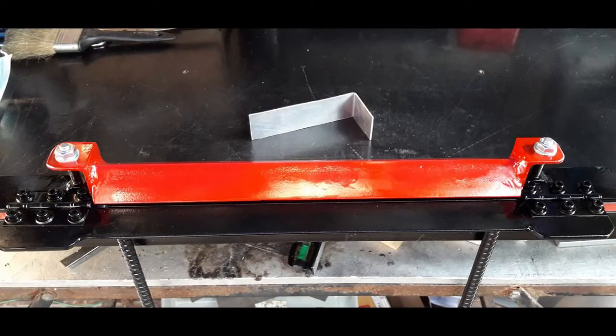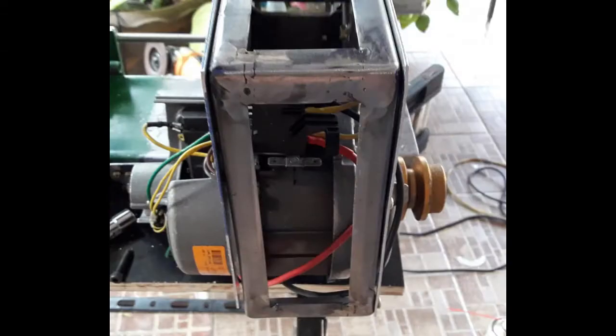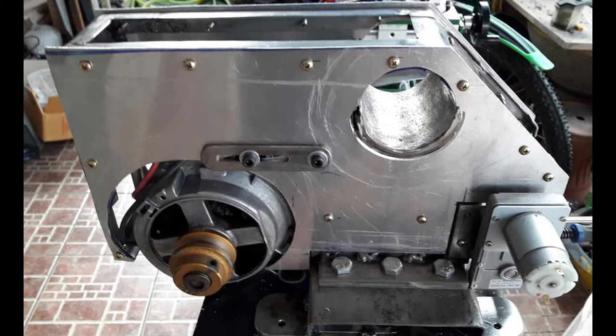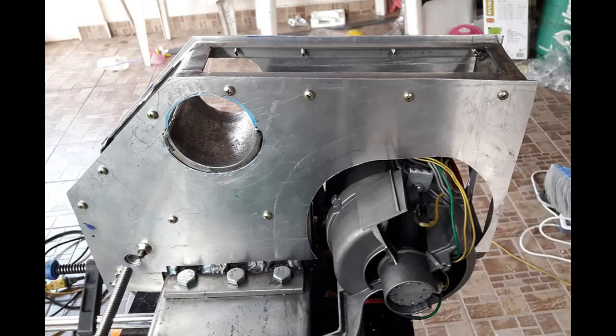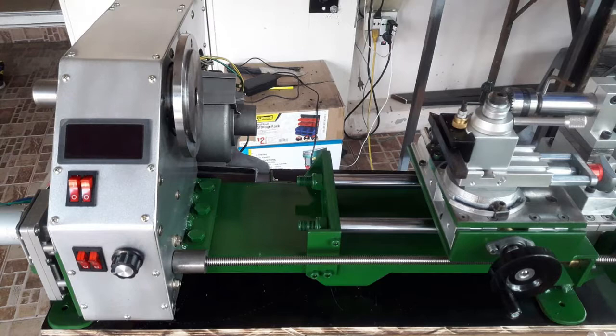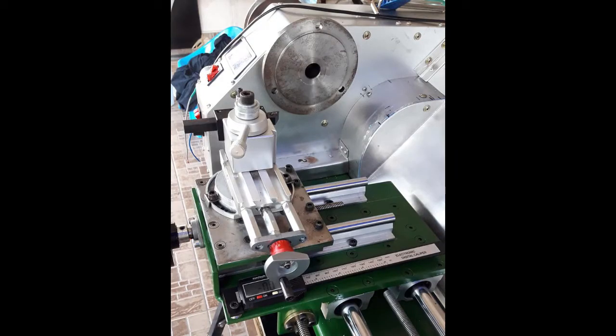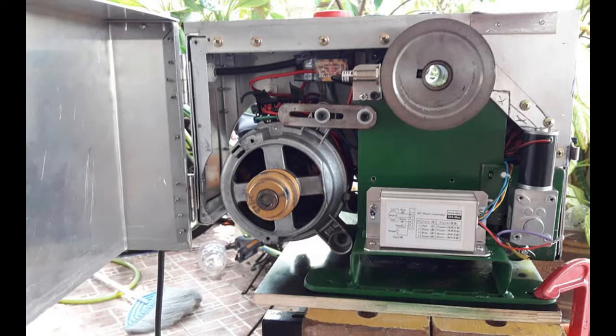When I got to the point where I wanted to start building some covers, I made myself a small sheet metal bender which just clamps onto the bench and does a pretty good job, as you can see by that little sample piece sitting on the bench there. One of the local steel merchants had this three-quarter angle — it looks as though it's folded from a sheet — which allowed me to keep things compact and build a framework that I could mount some aluminium sheet on, bought from a little engineering supply place. While making the covers I built a splash back and had to incorporate somewhere to allow for the back of the motor, which was protruding out past the body of the headstock.